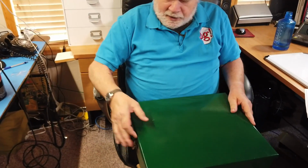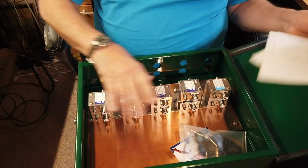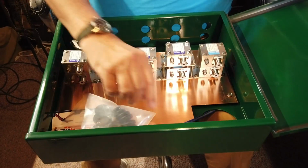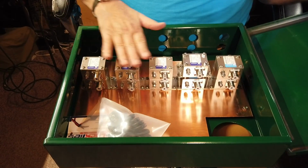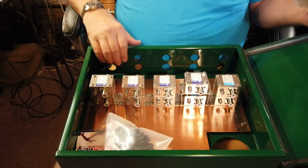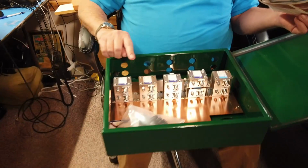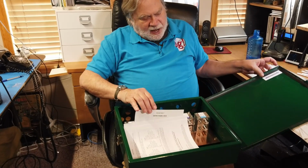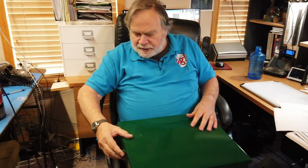And then when this thing opens, what you discover in here are all these lightning arresters. There are 10 of them in here of different types. I will be installing this very shortly because it's time to do that, and bringing all my antennas in through this set of lightning arresters. These are Morgan arresters, by the way. And using this, I'll take the cables, and instead of going right directly to the ground, they'll go to this. This panel is located outside, and it's got a nice water seal here to keep this dry and free of invaders.